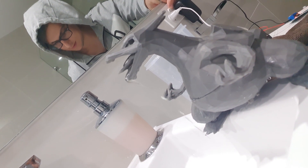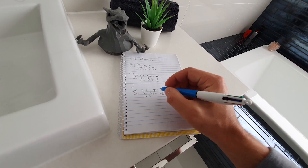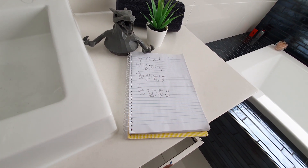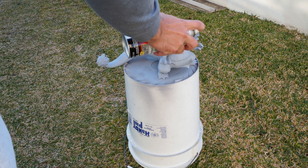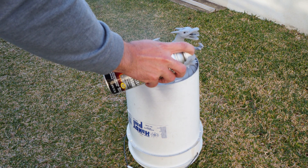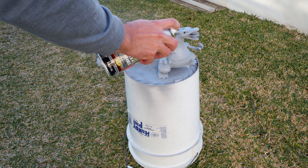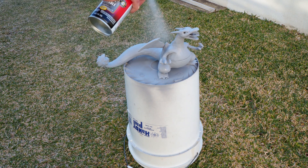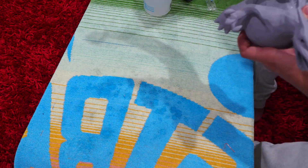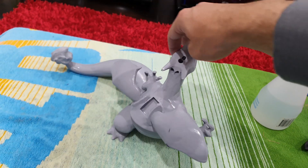After this, I tested the pump's capacity and ran experiments on how long it would take to fill the diffuser. Midway through testing, I got a bit bored with the basic grey printed model and remembered one of the famous sayings: if you're ever going to take a photo or video of anything, give the model a good sand. I started from 80 grit and went all the way up to 400 grit, ensuring I got between all the cracks and crevices. I then primed the model with some Rust-Oleum sandable fillable primer to mask out the printed layer lines, then gave it another sand with 400 grit to remove the primer bumps. After another coat of primer, it was time to give it a wet sand — 600 grit all the way up to 1500 — to give it a nice glossy texture before proceeding to paint. As you can see, it's nice and glossy and shiny.